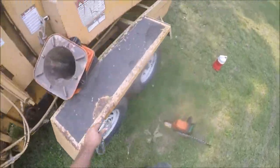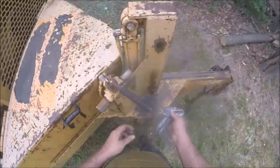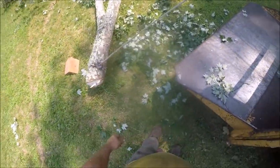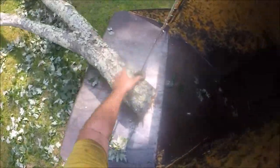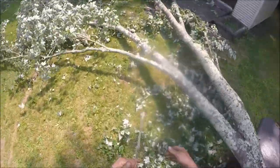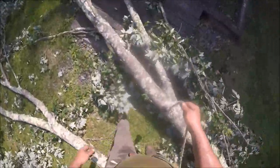This swung nicely, it's coming right in, but you see how far in I am - that's not good. Those metal clips I left on the stump there would have really sucked if they got hung up on the brush and got chipped - that would have been bad news. All I'm gonna do here is use the winch to lift the log up onto a block like so, and now I can move the line up closer to the end. This way it doesn't shoot underneath the hopper when I swing it around. The closer to the end you are, the closer the log can be when you lift it into the hopper. Put it down, hold the line out, stretch the line to pull it in.